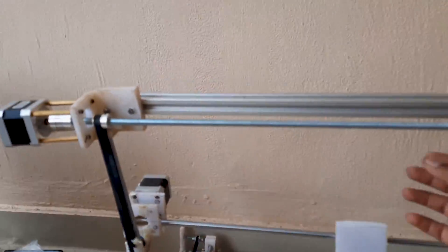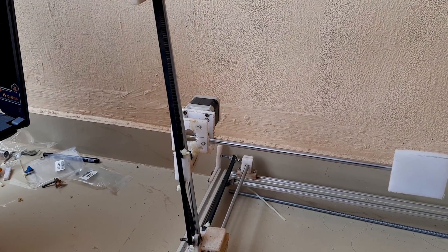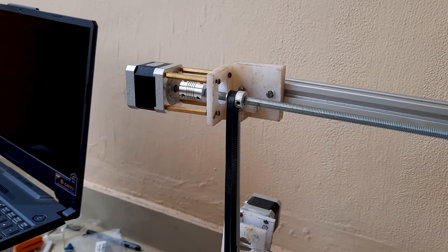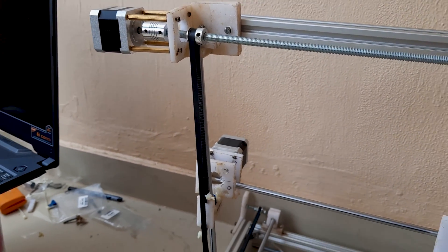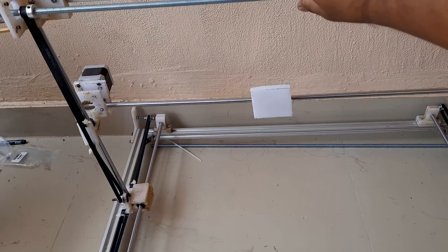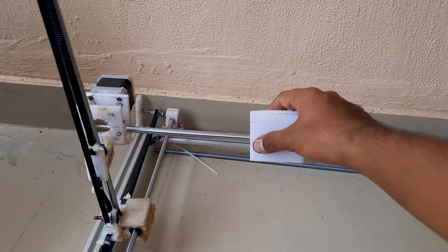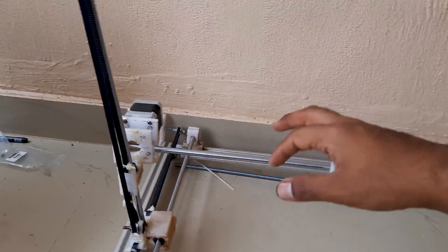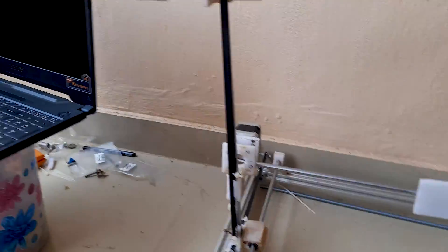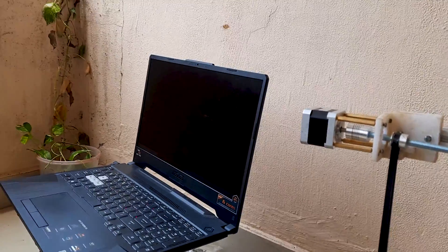All the main structural components have been fitted. The Z-axis motor has been fitted and now the column moves up and down with the motor rotations. There is a lot of load on this Z-axis motor so I'm not sure if it will pull, but the calculations say it will. The movements are happening — the whole column is getting lifted and also coming down. For the X-axis, I'm just waiting for one pulley. We can start fitting the Arduino boards and CNC shields and figure out how to program all of this.